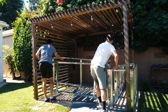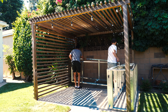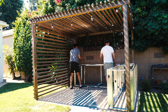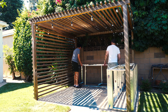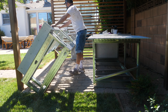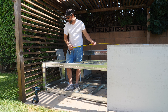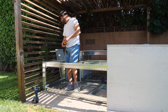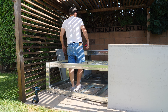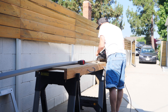This is the part that will hold the barbecue, and the reason it doesn't have many studs at this point is because I was going to have to move it back and forth. Because it goes against the wall I wanted to lay it down to finish the back side — only a few inches of clearance. I realized as we were moving things around I got it out of square, so I muscled it back into place and checked each corner measurement to make sure they were the same, which is a good indication you're relatively square.